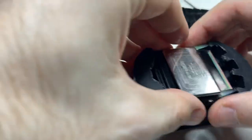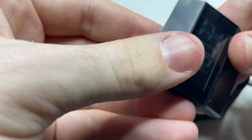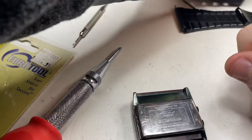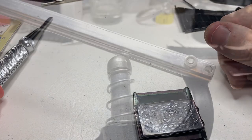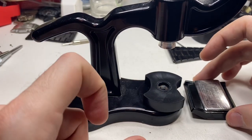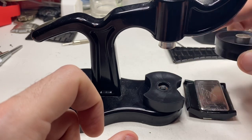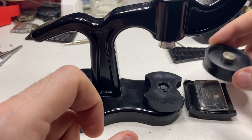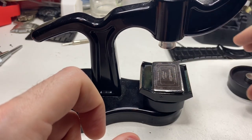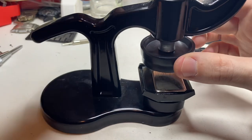Then we can just use our hands — we'll have to use a press to put that on. The watch is working. So this was really hard to get off, so I'm sure it's going to be quite hard to put back on — that's the flip side. We're going to use a case press. We have this flat one, so we're going to put the watch like this. I'm going to use the 40 millimeter, because I don't have one that fits this better. I want to use this one on the bottom, and the 40 millimeter is going to go like this and push it in. Make sure this is lined up where we want it.